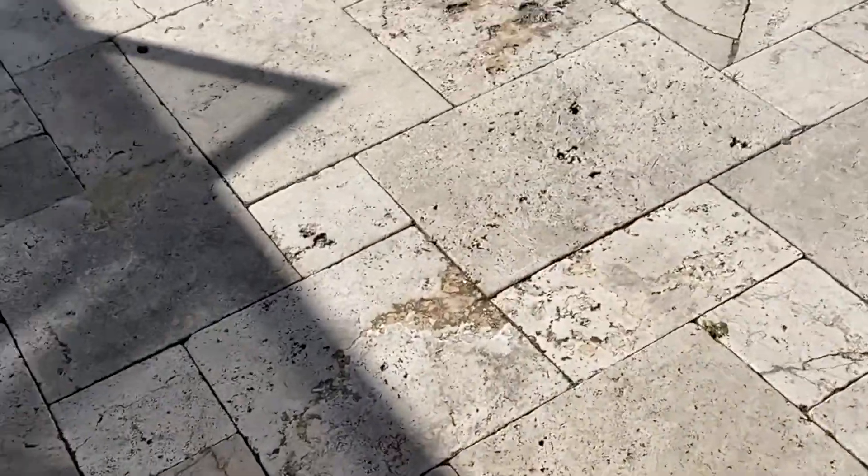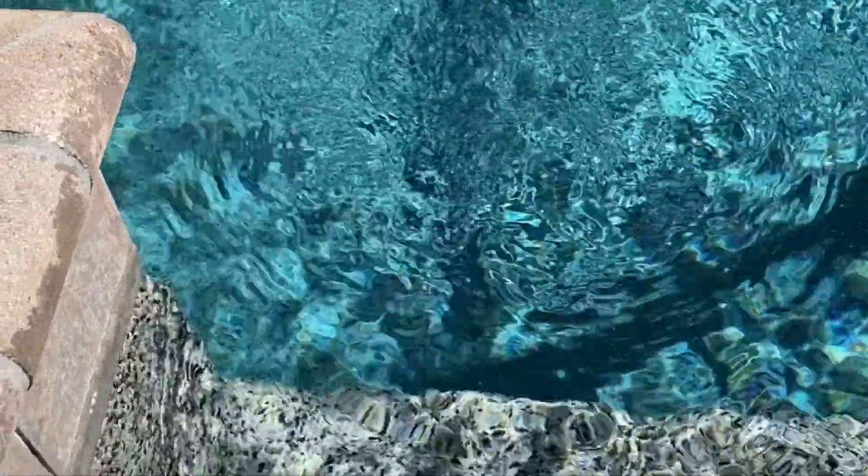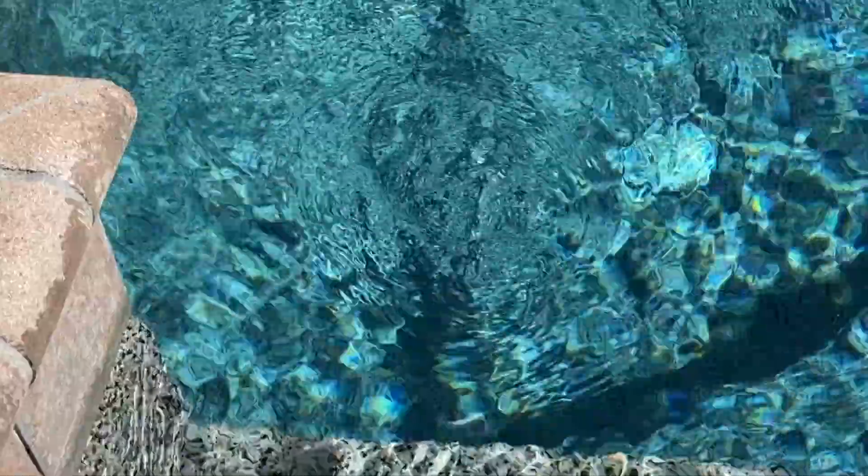After it's done priming, simply check that the flow feels good. If you see too much water bouncing out of the pool, lots of bubbles, then you might have a leak somewhere. Make sure you don't have a leak around the filter, pump, or somewhere else. Often I've seen leaks around the chlorinators — if you start seeing champagne bubbles, that probably means you've got a leak around the chlorinator. Just FYI.